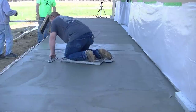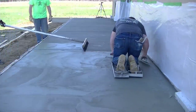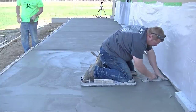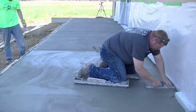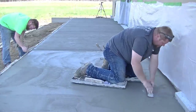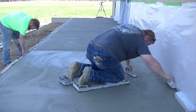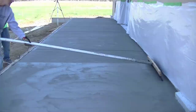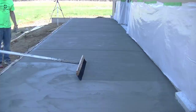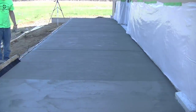Those skids work really nicely for doing this type of work. If you don't have them, there's a link down in the description — you can also find them at most concrete supply stores. You can see how much nice cream and paste is on the surface as Luke mag floats it out. He can use that to fill in anything he needs or leave me a really good surface to broom. You can see his mag marks, and then you can see me brooming right over him — just how nice a broom surface that leaves.